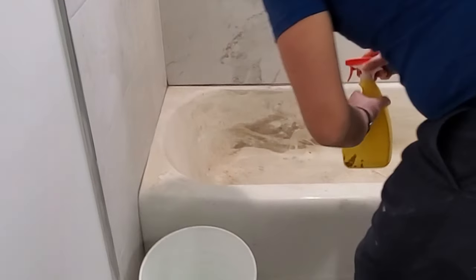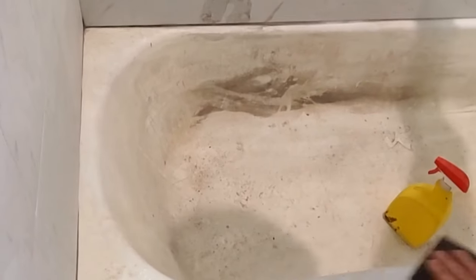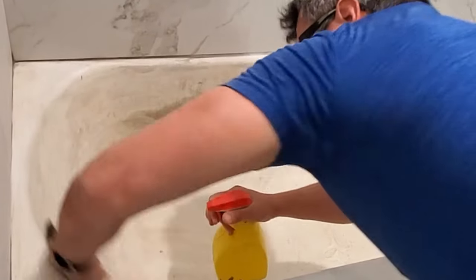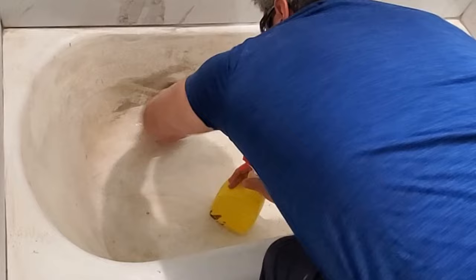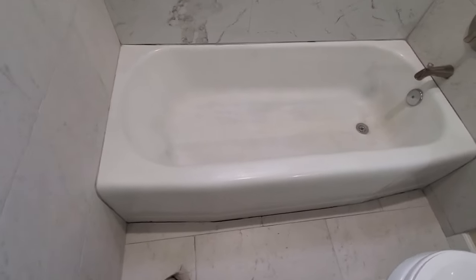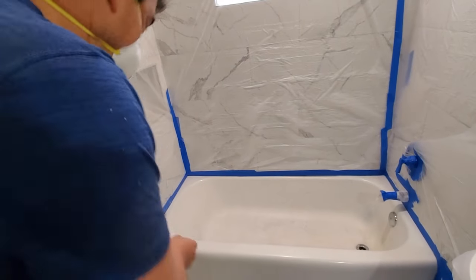Because I have a lot of junk on this tub and it was abandoned for many years, I want to make sure I take off as much as possible. So I'm going to use some cleaner that I have, and later on I'm going to mix the cleaner that comes with the product. The product comes with a cleaner in powder form — you dilute it in warm water and use it carefully on your tub surface. I have this scrubbing pad; I normally use these little pads to clean tubs or surfaces that I want to paint. You can find them in the paint section of your home improvement store. Once you have it nice and clean, look how different it looks — though it still has stains from years of use.